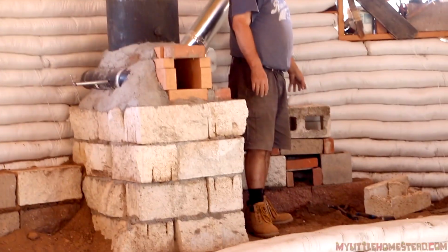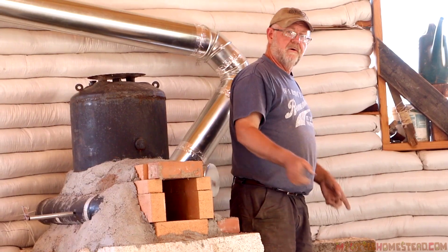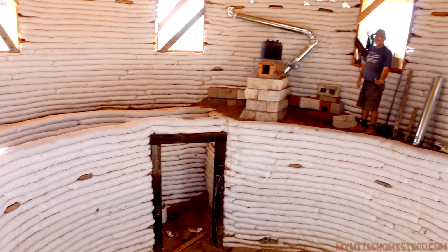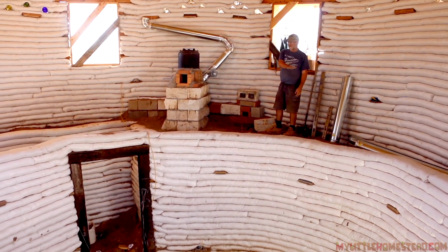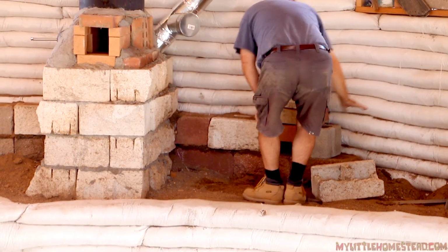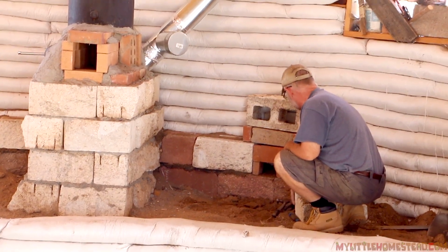We have a vent right here that's supposed to vent the subfloor underneath the floor that we're going to be putting here. And since we have dirt down here, it's nice to have a little bit of airflow in the subfloor to the outside. So that's the height of the steps; the top of the floor is going to be put in here. You can see there's a difference there, I don't know, 18 inches, maybe a little less. The floor is going to set at that height, right about here. So that continues all the way around the building. Yeah, and the vent needs to be below the grade of the floor. So that's how the vent ties in.